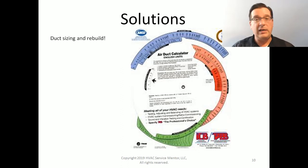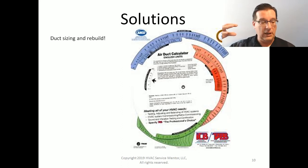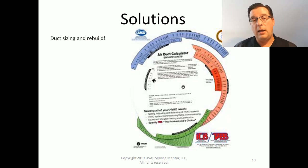In homes that have basements, especially finished basements where the furnace is kind of in its own little room by itself, very frequently it's easy for us to tap an additional 10 or 12 inch duct right through that wall from the return side, through that wall into that cool basement space, and then pick up that air from the basement and flow it through the rest of the house. And that can go a long ways toward restoring our airflow. And oftentimes it can help that upstairs bedroom get the airflow that it needs.